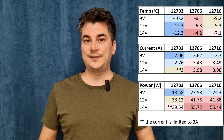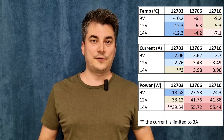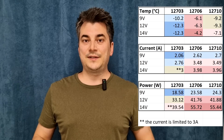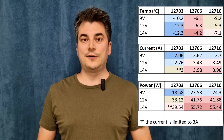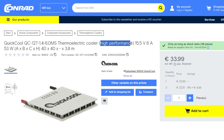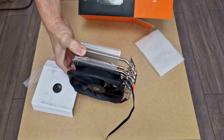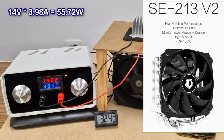Let's talk about the results. The best results are in the range of the 127-03 module — it has the lowest temperature powered with the nominal voltage of 12 volts, and the power consumption is lower compared to the other modules. It's better to use 2 of these 03 modules at 9 volts instead of one of the other modules, and you will still have a lower temperature and lower power consumption. Keep in mind that the Peltier modules tested are pretty cheap and probably of low quality — high performance modules will definitely deliver better results, but they are expensive. The highest power consumption recorded was 55 watts, and the CPU cooler is designed for 130 watts.